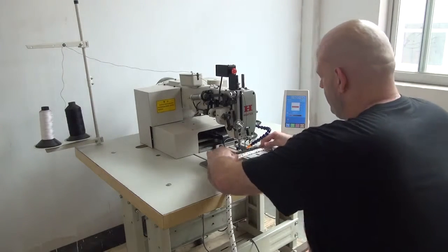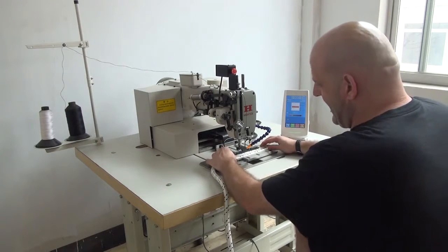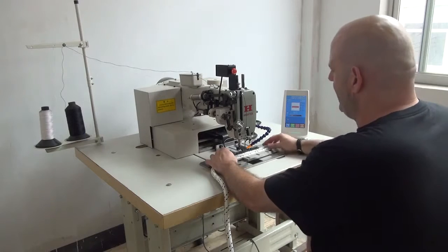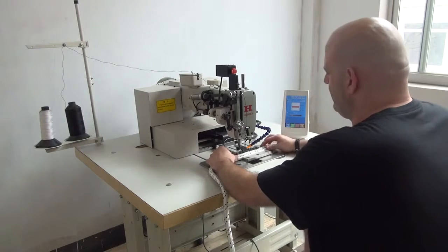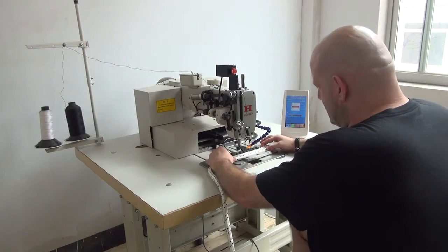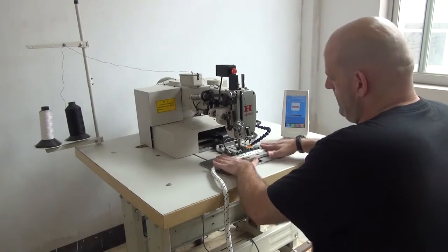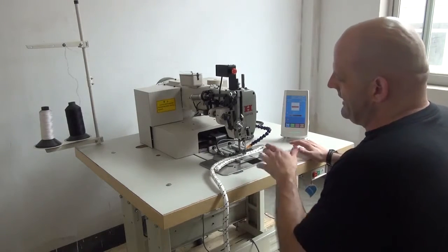The next thing we do is insert the material into the machine. Then I am going to press a pedal mechanism down here which is an air activated clamp mechanism. There are two pedals down here, one on the right and one on the left. The one on the right is used to activate the clamping mechanism. The one on the left is used to activate the sewing machine when you are ready to sew the pattern. I am going to push the pedal on the right hand side and that squeezes the clamp together so that it holds the rope in an even grip. And then after that we are going to press the pedal on the left hand side to sew.